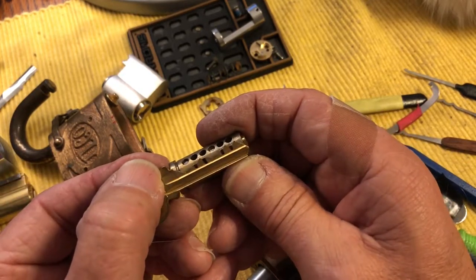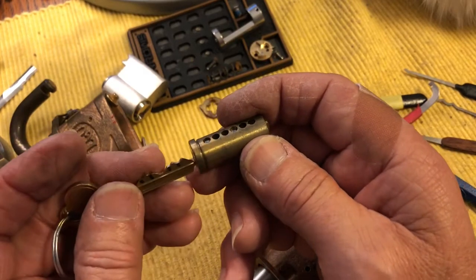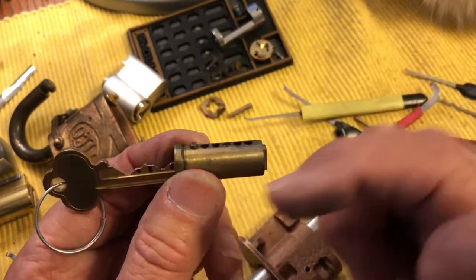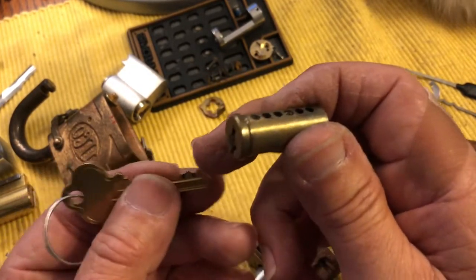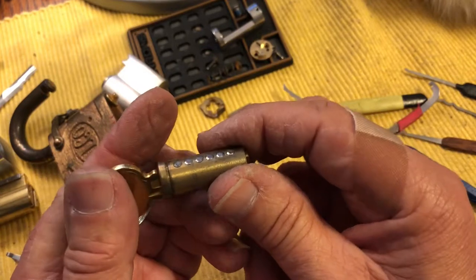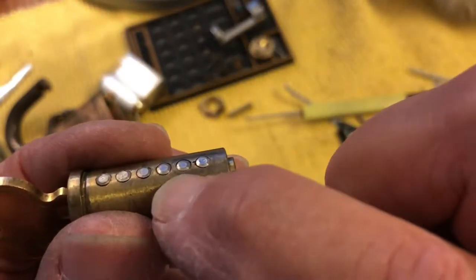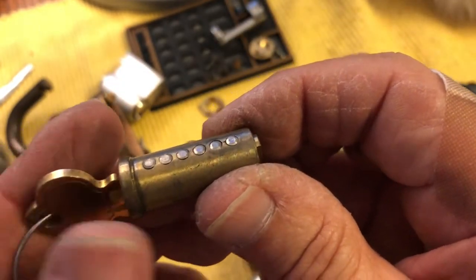Then what I do is I cut on my machine — I cut all these at a zero. And you can come in here and say you have your blank in there — this is your key pin in the correct position. Well, it's sticking up, so that means you have to file deeper. You can work at one pin at a time, make it so it fits, so that when you get them all in there they're all nice and flush. These are all original pins; this one is not because I went too deep. This is out of a Lockwood pinning kit that I happen to have. So now we have a working key.